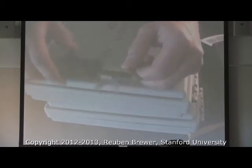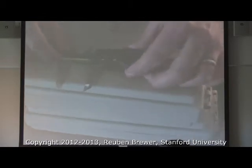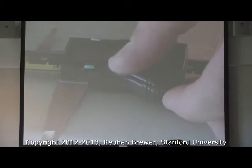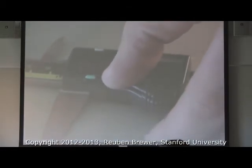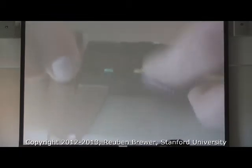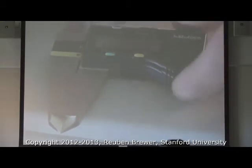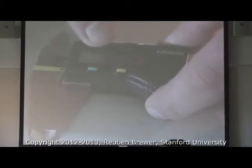Let's look at the buttons. The little green one is the on/off switch. This little yellow one is zero — if I press this right now, it would read zero, and anything from that would be incremental. But really what you want to do is close the jaws and hit zero, so that's true zero. This little gray button switches between inches and millimeters very quickly.